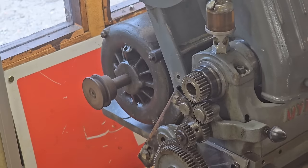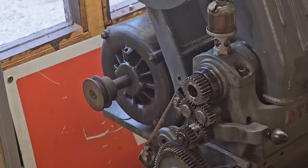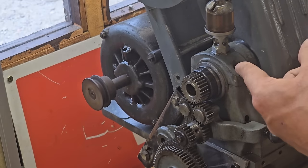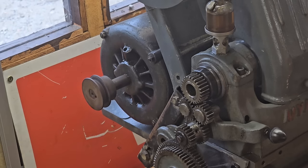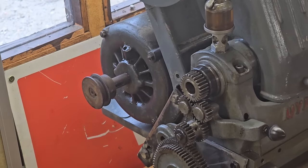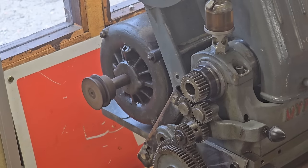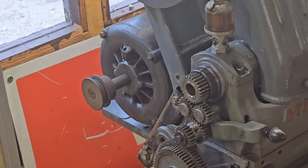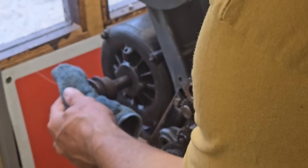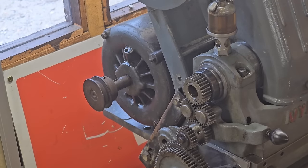I say, when I had this to bits, there was all congealed grease in the bearings. I had the front bearing out, the back bearing. I just heard that centrifugal switch click. And I'm like that. Let's try it again in case that was a fluke. There we go. And she's off again. Oh, I can't believe how nice that's spinning down, look. I heard that centrifugal switch click. So that's clicking as it should.